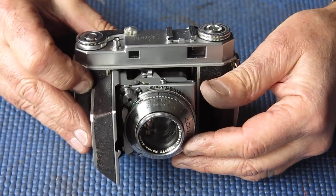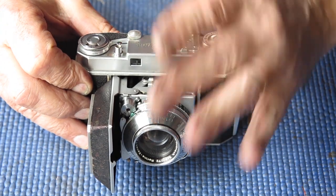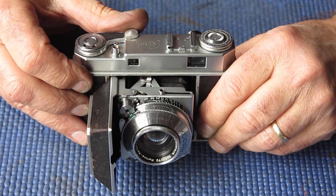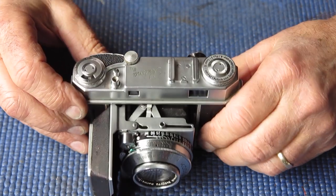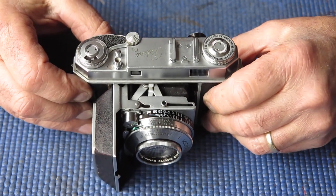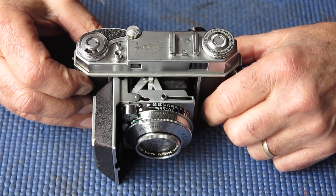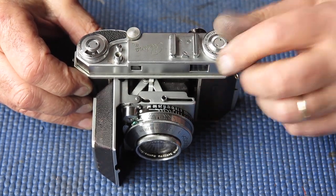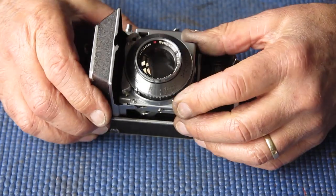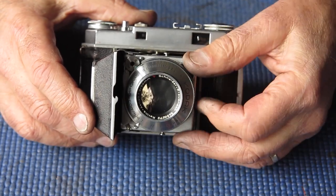Most likely the timing of the cocking rack to the shutter was one tooth out. I think that's probably the biggest influence there. That can be influenced by changes in tolerances over time as parts wear and things no longer push things quite as far as they used to. No significant problem, and certainly not one that was hard to deal with. The shutter itself certainly needed servicing.